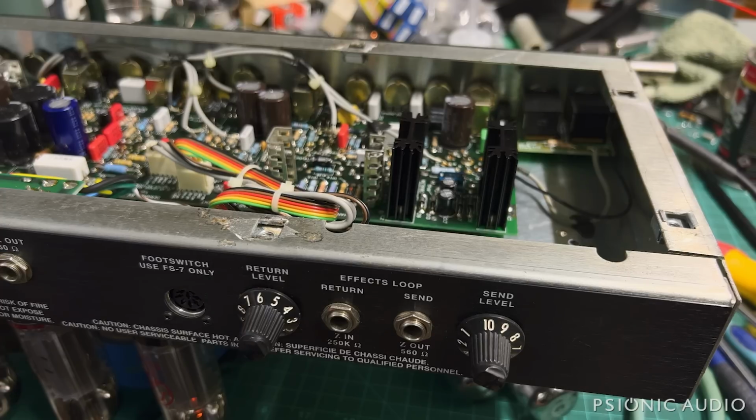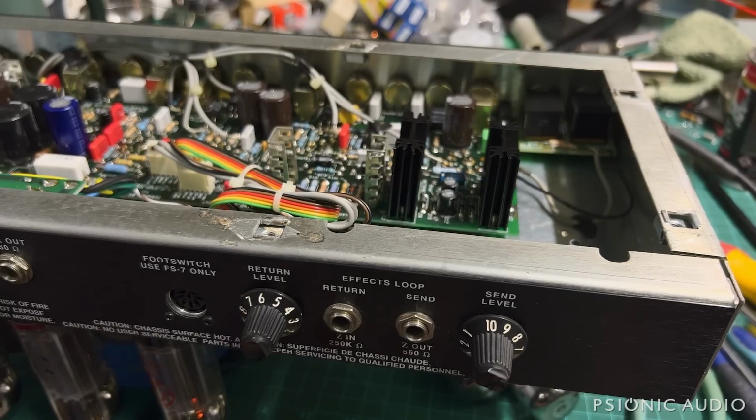Probably has a lot of bad solder joints, definitely needs those pots cleaned. That oscillation is a sign of a failing filter stage. Now, none of the individual caps are expensive, none of them are that difficult to change out properly. The issue, as always, is getting the board out to access the other side. It does not seem to be as bad on this as it is on, say, a Mesa. So I think if I remove all the switches and knobs and nuts on the pots on the front panel, the whole front panel will lift out and up and I can access everything. So this is not a deal breaker.